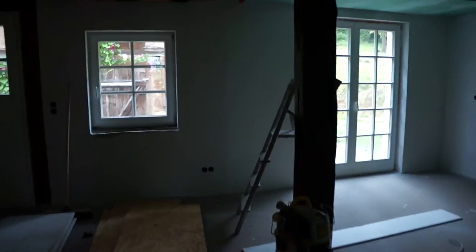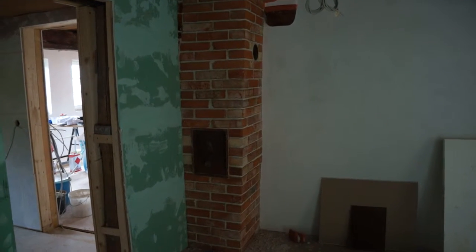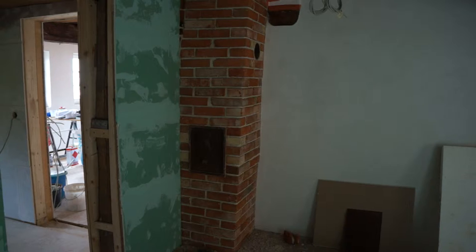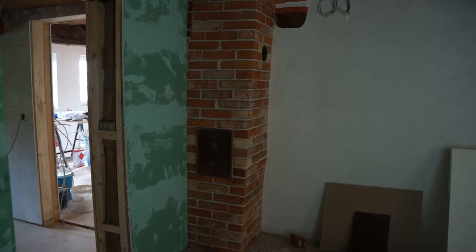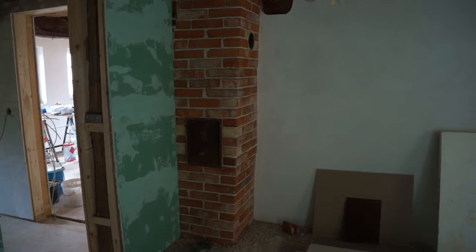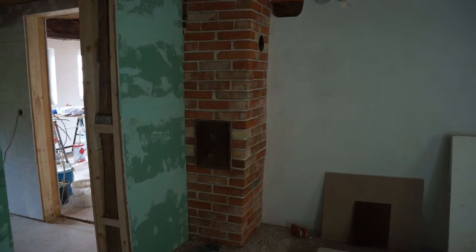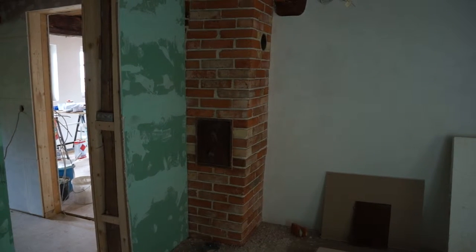In the kitchen, nothing much changed since last time — maybe just some filling. But yesterday I did the jointing or repointing on the chimney here. Which is really easy — we've got this old-style mortar, which is pretty expensive, and basically you mix that up. In the cellar I used pointing trowels, which is kind of laborious, tucking the mortar in between the stones or bricks. This time I used a grout bag, which is basically like a giant icing bag filled with mortar, so you squeeze it in between the bricks and then use the pointing trowel to straighten it off and push it in.